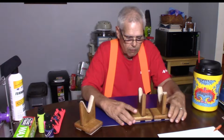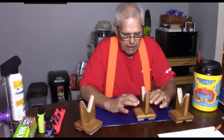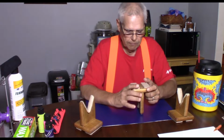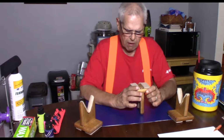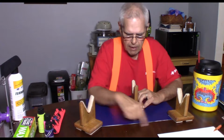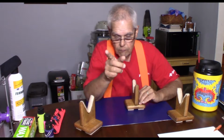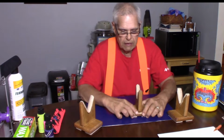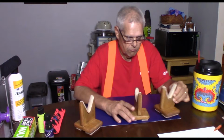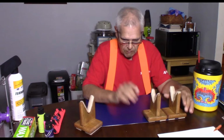In the original video, the first one, the short one, you don't see what had happened. I did about 2 or 3 of these when I was doing the countersink hole, and I'm going, boy, this is awful hard lining this up. This shouldn't be that bad. And I realized that I hadn't put a witness mark on my piece that I was putting up against. Well, that's when I went in there, and in the longer version, you'll see I drew a little line on there, and then everything lined up and drilled over there, and it probably increased the overall speed of drilling. Oh, probably at least 20-30%, 50%, who knows?